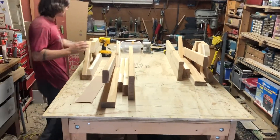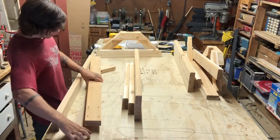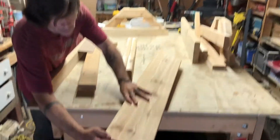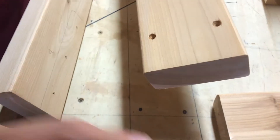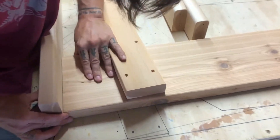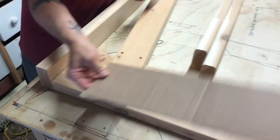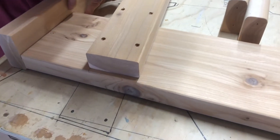We're going to work on one side. Get your backer and set that on a flat surface. On the back of this, this is going to be A. The next thing we're going to look for is B, which should be the bottom one. Wherever we find a match to B, we're going to line it up. We've already traced the outline of where this foot is going to sit, and everything's pre-drilled. You'll notice the line isn't quite meeting — that's what your shim is for. Put it right underneath, and now it's lined up perfect. B with B.